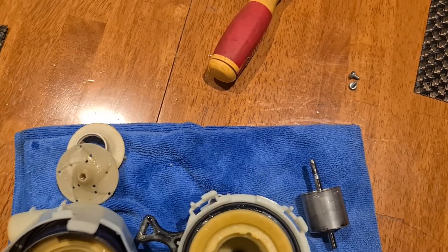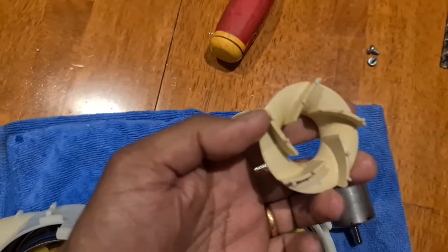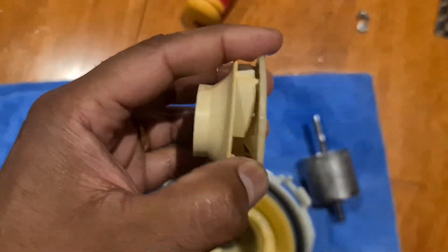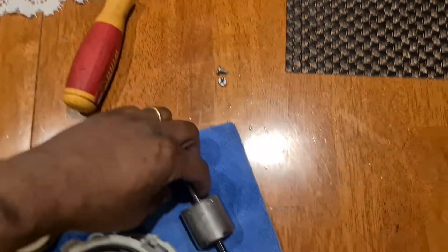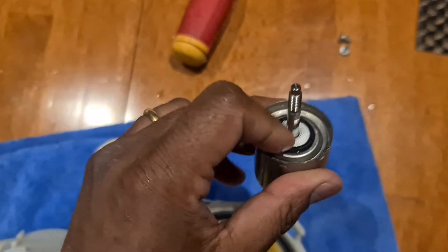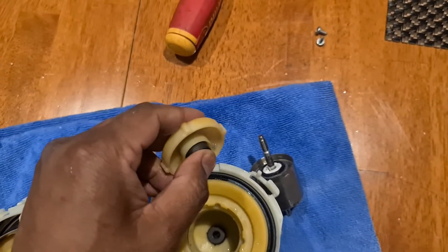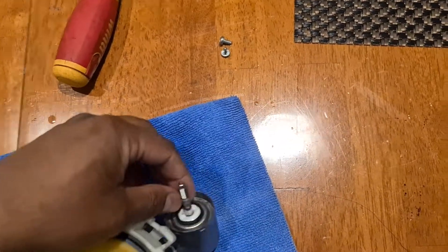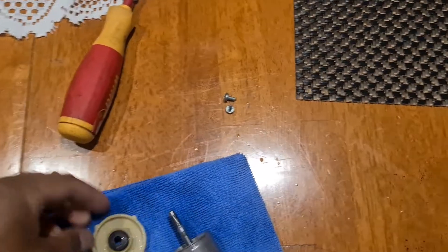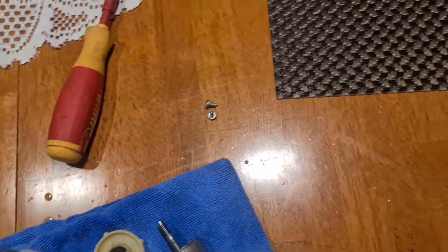The impeller is made out of two parts: one is the impeller assembly, and it's mounted onto a base like this. This is the magnetic rotor assembly and it's got a seal face over here on top. This is the other shaft seal that it runs against — there is a ceramic seal over here that rubs against this sealing face to create the seal.